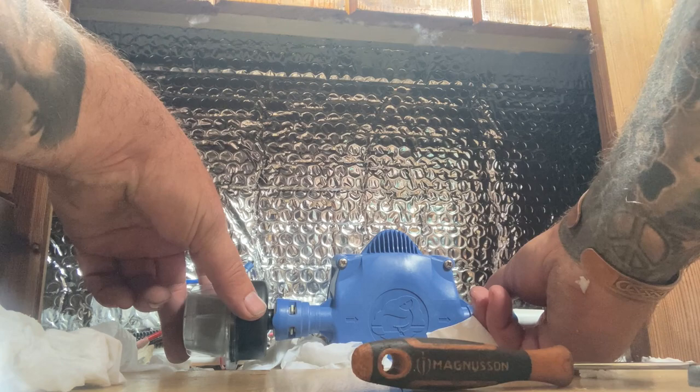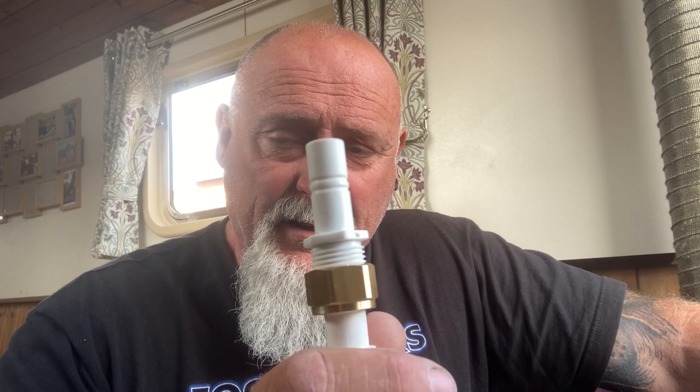So some of you guys may have spotted, he's doing that wrong. Putting the 15mm pipe into the pump. Yeah, I've realised that. A bit of water on the floor, there was. But anyway, I found the fitting that goes with those pumps. So those pumps have a special fitting. Those Whale pumps. And that clicks into the pump itself. And the filter plugs into the other side.